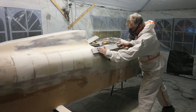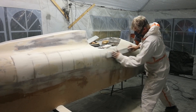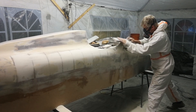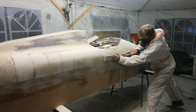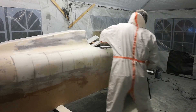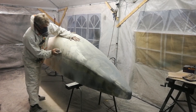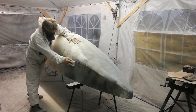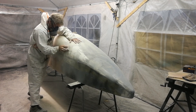Welcome back. Here we are sanding the main body — this is the center section of the entire race car. I'm sanding using a long block to keep things even and true. The longer the sanding block, the less likely you are to get uneven pits and dips. I'll use a small one for small touch-ups and the long one to keep things accurate.